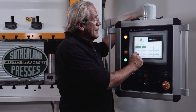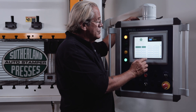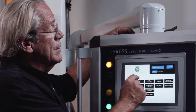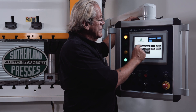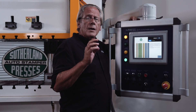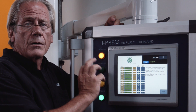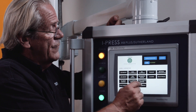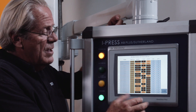Job library — it's as easy as once a job's been programmed into the control, you click the job name, hit select, go back to your main run screen and you're on the new job. The press sets itself up — back to level one operator. Cam status and die monitor status are fields for the operator to look at but not adjust, so these are viewing fields only.